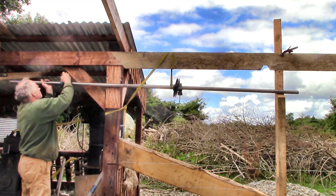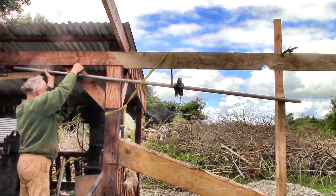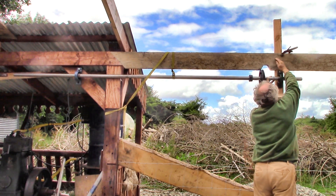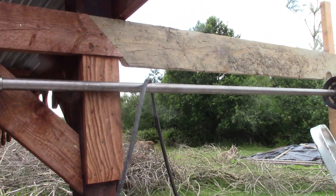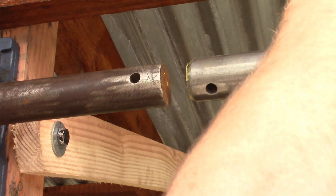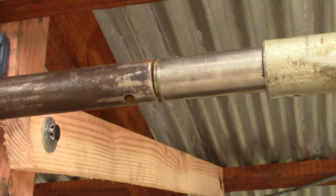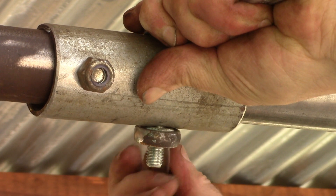Will had gone again by the time I was ready for putting this up. It's a bit heavy and awkward. But after a lot of tweaking I got both shafts lined up with each other. But how to connect them? Well, apparently it's as simple as a loose collar — pairs of holes at 90 degrees to each other. I'm using nylon nuts so they don't fall off.